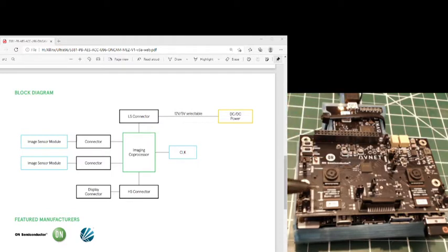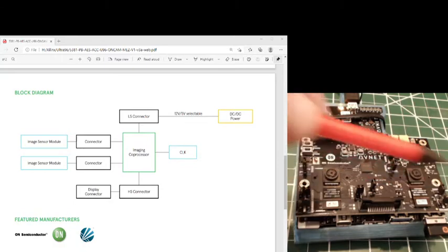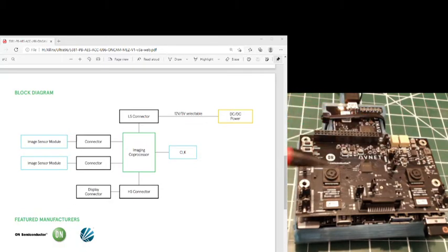There's a bunch of jumpers here that you can put on, and these have different features as far as how to configure this. I'm just using the default out of the box. Here's where you can see the 40 pin low speed connector out here. I guess you can stack, I don't know, make sure there's no incompatible interfaces. And then on the side here, they broke out the reset and the power button. So here you can actually power the whole board through this button and then reset it. This all gets tied into the Ultra96-V2 rather than having to reach down there.